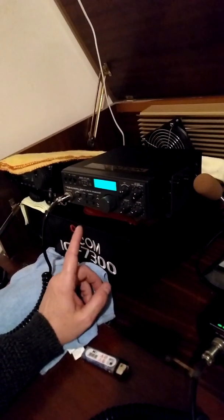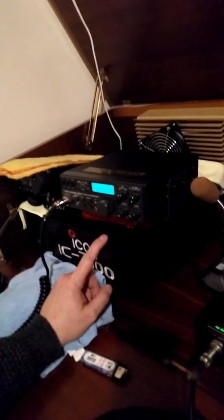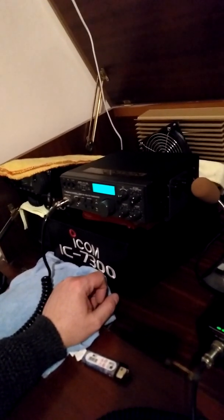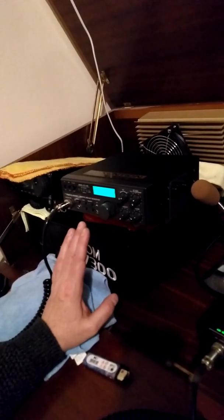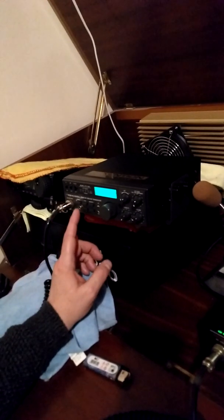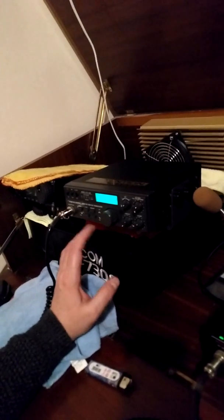Oh yeah, the CPU in this is very, very similar to a Lincoln. The pin numbers are different by the amount of 6. And if you study how a Lincoln's designed in the circuit diagram, you could pretty much figure out what's going on. At the moment, this has only got 2 offsets when you go between CW and SSB.